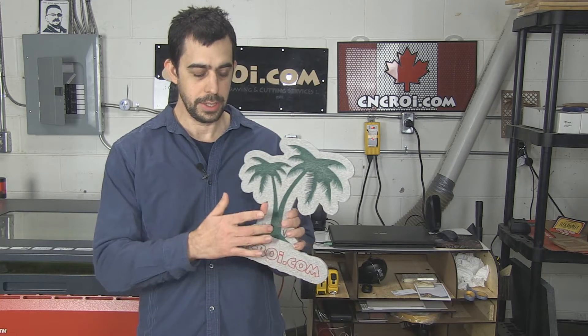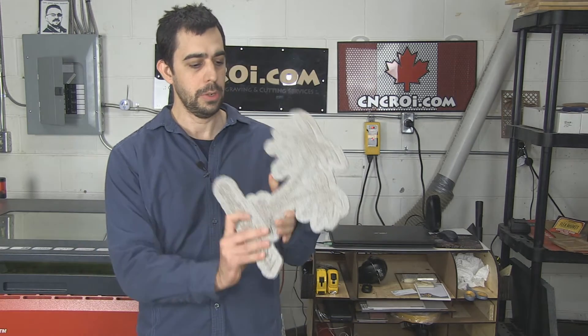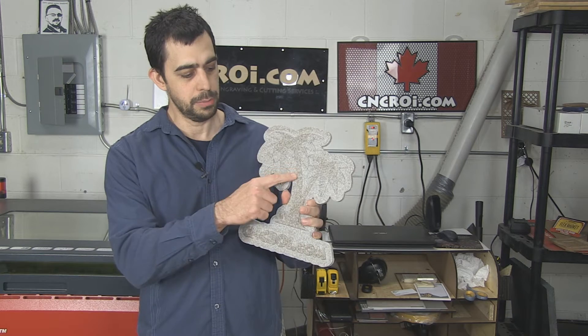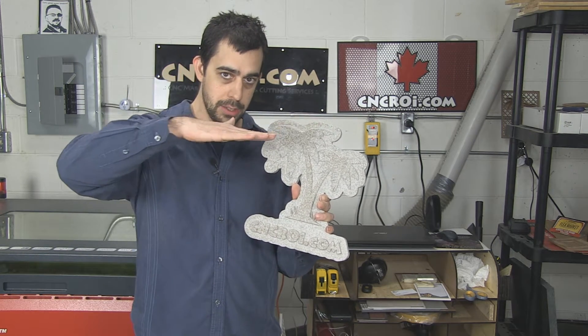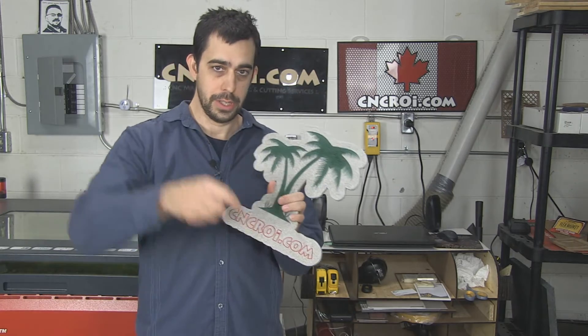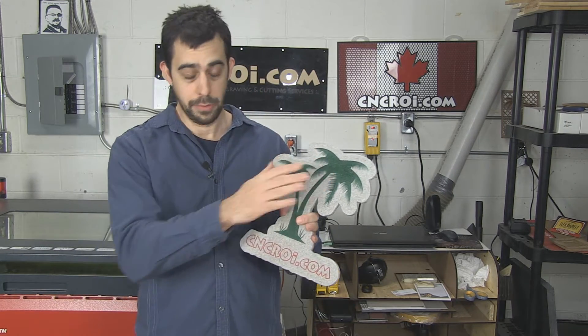When it comes to Corian, one of the advantages of using a laser over a router is that the surface is actually incredibly rough. So that means there's more surface for the paint to adhere to. When you're doing it with a router it's actually pretty smooth and somewhat sanded, just because the bit is going over at a constant height, but with the laser it's actually a beam of light going all over the surface. So that's why you get more surface area.